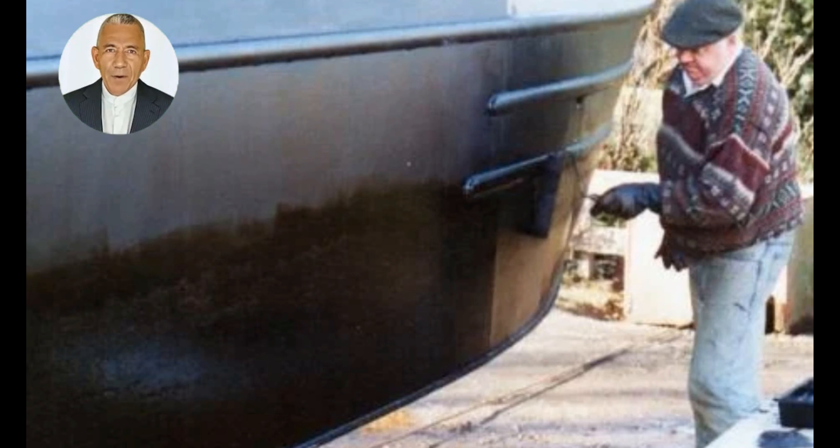Let's look at two-pack epoxy hull blacking. Ask about the two-pack epoxy guarantee — expect between 4 and 10 years, but be mindful that the coating is likely to get damaged by those typical narrowboat bangs and scrapes, which may wipe out any guarantee. If your narrowboat already has a two-pack epoxy coating and the manufacturer is known, it's usually best to stay with the same brand.